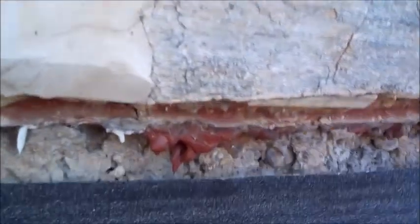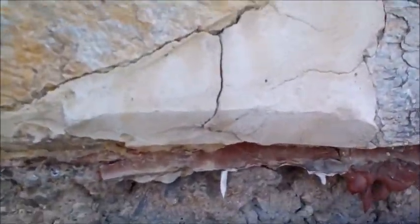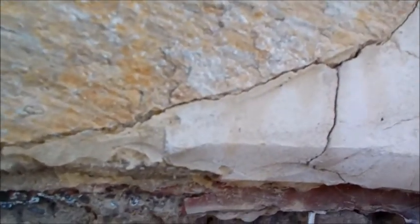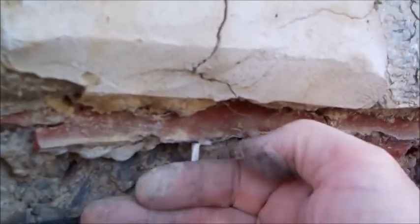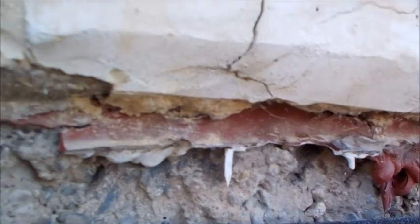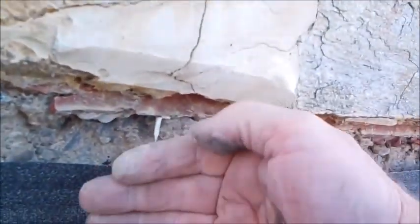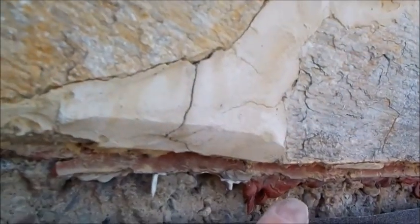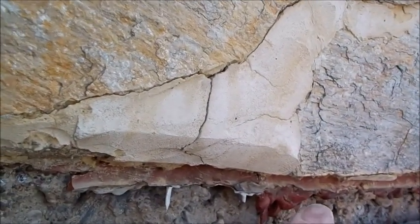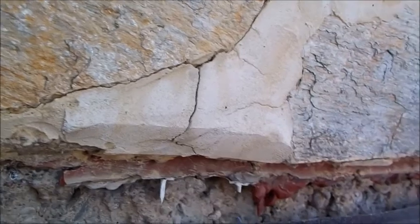And I've just chiselled out the cement work, so I can tuck the lead in there and then point it up. But if I tuck the lead in there without putting anything on the back, it'll just sink in. So I've got to put two pieces of wood on there to bring the wood out to about here. Then it will sit up, the lead will sit up against there, quite flush. And then I can just dress it down over these tiles, and that's that. And the same with the back. So I'll crack on with that, I'll show you when it's done.